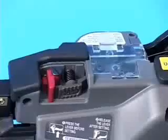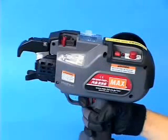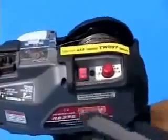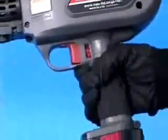When tie wire gets jammed around hook parts, remove it according to the following process. Push the release lever to disengage the feeding gears. At this state, pull the trigger. The tool makes these 4 repeating beep sounds. Turn the main switch off, lock the trigger, and then take the battery out. Confirm that the twister is in its extended position. Cut the wire and remove it with pliers.